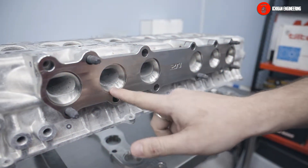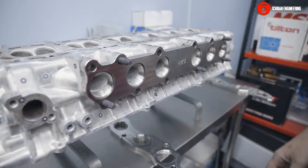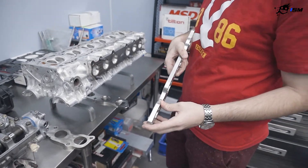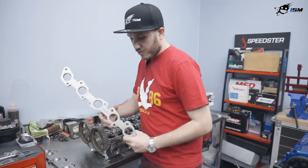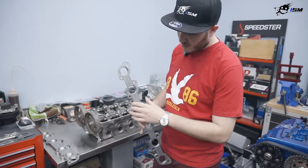It tapers from the port to the side of the tube — perfect fitment, no worries. The flanges are about 13mm thick, just around half an inch, a bit extra. Perfectly flat, perfectly machined. This is an example for an RB26 as well. Same thing with an RB — the pattern is a bit harder to make.